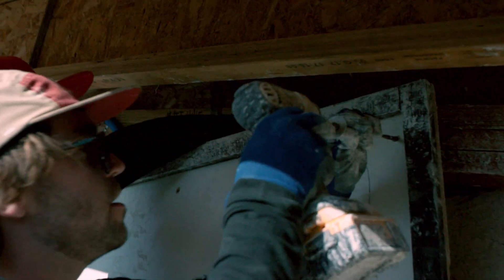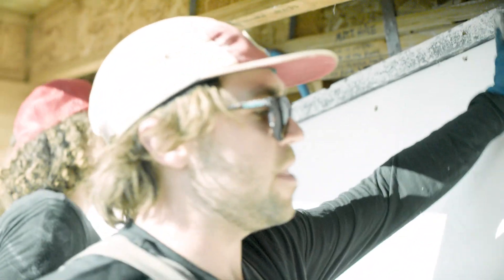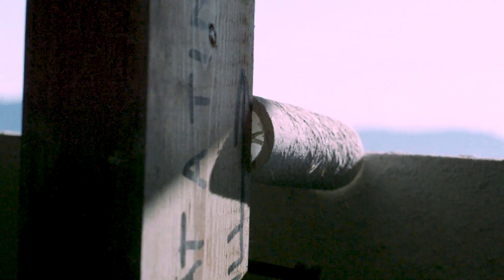I have the top plates here that I can angle toward. I want to make sure I'm not in the middle — you're always grabbing framing. We tighten that down on the four-inch spacer and that's what maintains this distance for our wall.